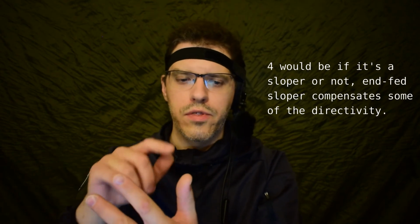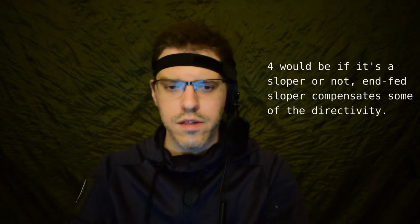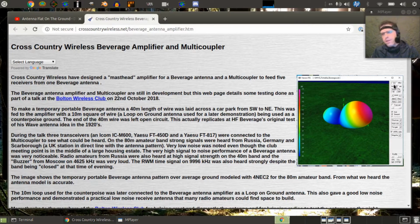But we're talking about the frequency and the length of the antenna. And obviously here I think it says 3.6 megahertz, and it runs along the x-axis here and gets this radiation pattern. And then you can see that this near vertical incidence skywave type of communication that we want to have, which is basically straight up into the sky, doesn't seem to be that much energy there in this radiation pattern. You get a little bit fooled by these models unless you look at the actual numbers.